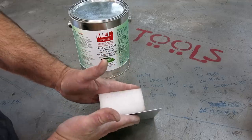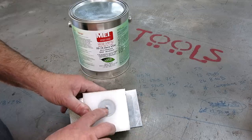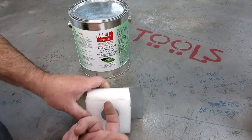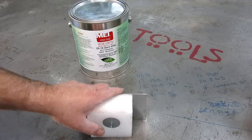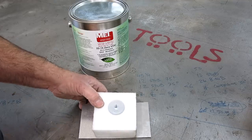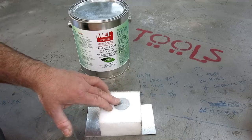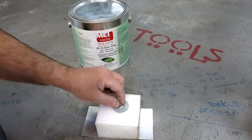And then this overall height, you know, from the base to the tip here, I don't think I need to cut these off. You know, the nails are 2.5 inches, and I have kind of a 2x4 depth to work with, which is 3.5. So should have plenty of room, and I don't have to do anything because these will be covered. So now the ones on the ceiling, I'm not planning on covering those. Anything over 8 feet, I'm not planning on covering the insulation. It'll just have whatever facing it has on it. And so will I clip those off? I don't know. It's pretty unlikely I'll hit my head on them, but you never know.